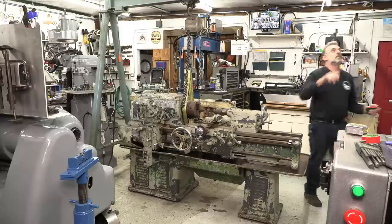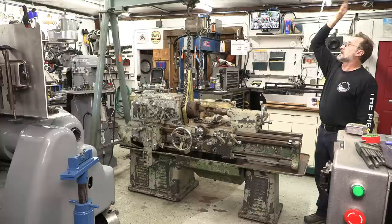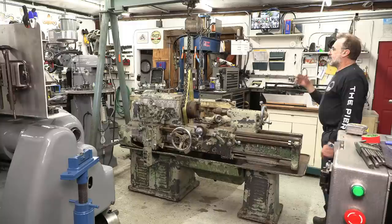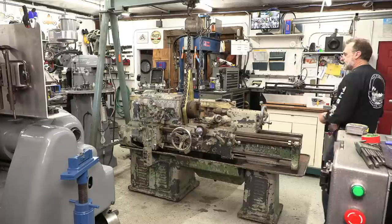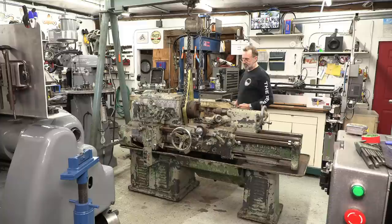And I did a couple things. I made it round. I put two pins up top to keep it from anti-rotating. I also have made two sliding blocks that I can T-nut. Use them multiple purposes. I put this surface against to keep it square at the end, or bring it in, and then I tighten it down so that I control where the gantry is going to stay if it wants to travel. It really doesn't travel too much in this direction here, but the floor does slope that direction there. When I'm crosswise with the lathe right here, I can almost take my chuck out and then just let go, and it'll come back to the aisle and farther if you let it go farther.